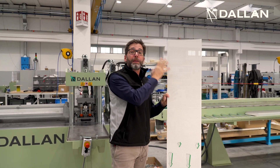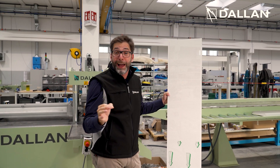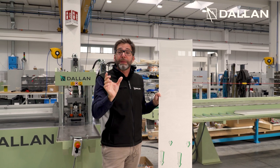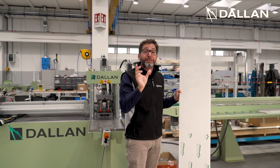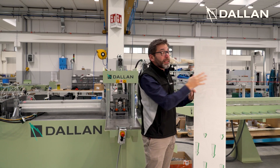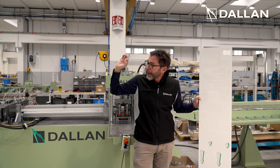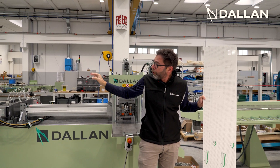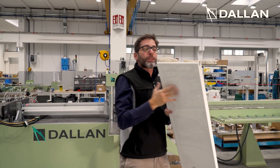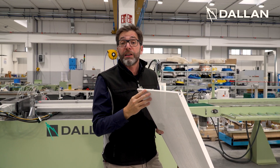Very thin materials, pre-painted materials, and they need to be perfect out of the line. This line makes panels from 100 millimeter up to 450 millimeter in width and is used mostly for perforated and non-perforated panels for metal ceilings. A line with uncoiler, straightener, roll forming, notching and cutting, and bending which provides the panel an additional strength in the transversal direction.